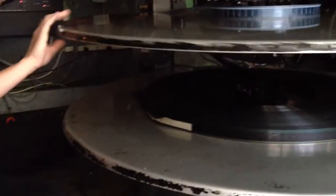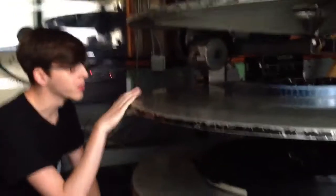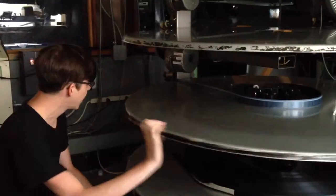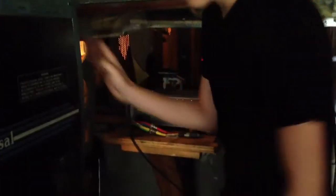And then the platters — when you take out the platters, you switch this one down here to pay out, because it's paying the film out. You switch this one to take up. And then when you spin it, it engages the waterfall. So now the waterfall is up. I'm just going to check my mark. The wall looks good.